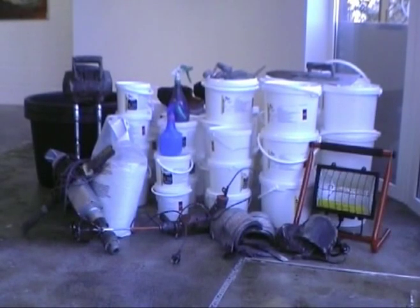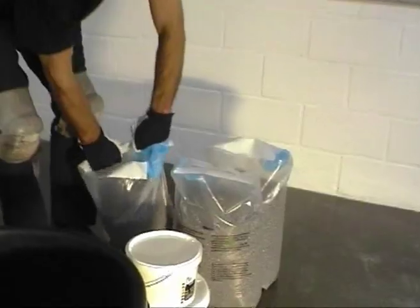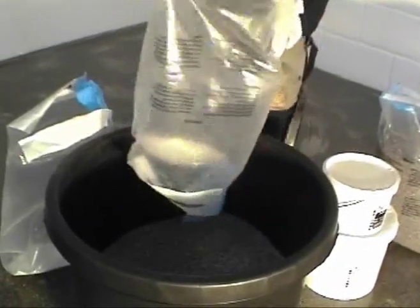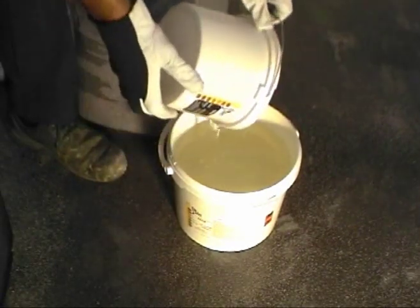The quartz stone flooring is installed by utilizing quartz granules, which are available in a variety of sizes, and a specially formulated epoxy or PU binder. The applications require some specialized hand trowels and mixing equipment.